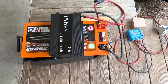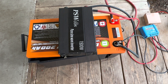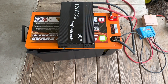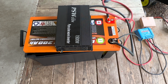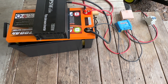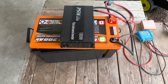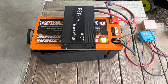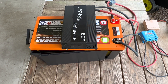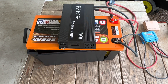In today's project we're going to dovetail off a couple of the last videos I've done. A couple videos ago we did a review on this EnjoyBot 200 amp hour lithium iron phosphate battery - it is still currently hooked up and just sitting here in float every day. Because I had that 24 volt inverter fail on me the other day, I'm going to slide this in where the 24 volt battery is and revert that charging station from 24 volt back to 12 volt and put this into production.